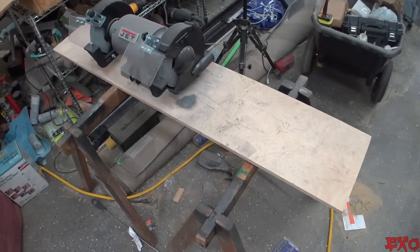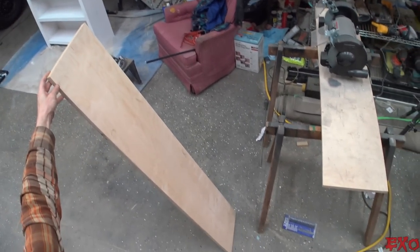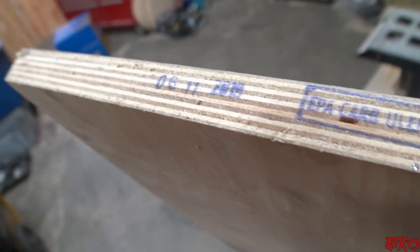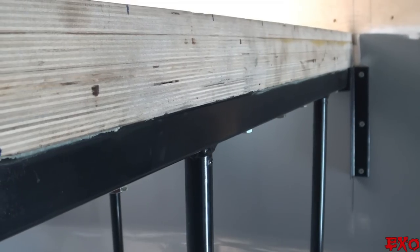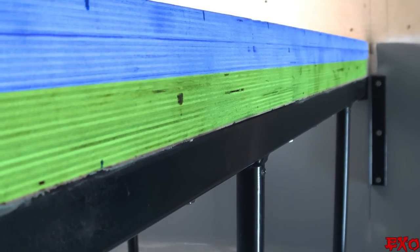Couldn't find any small slivers that fit, so believe it or not, I recycled the wood from my sawhorse bench. It's super high quality 13-ply Baltic birch, and it's actually from my original batch in Russia from 2019. The ports will join halfway up the 3-inch baffle thickness, leaving an inch and a half of material to stagger hardware into across the seams. Should be pretty beefy.